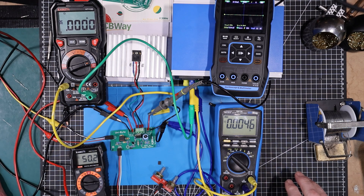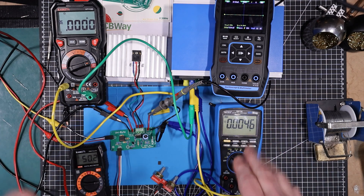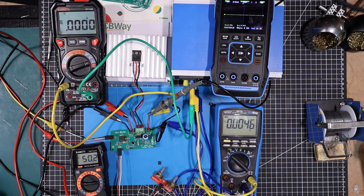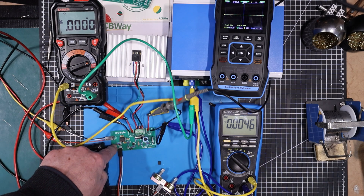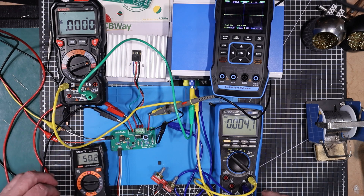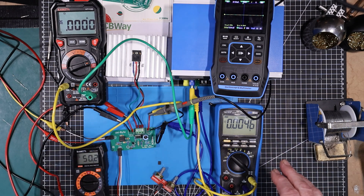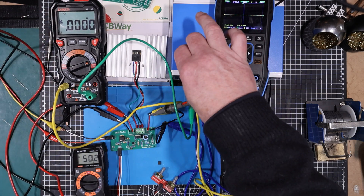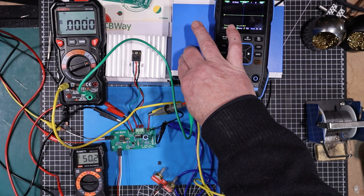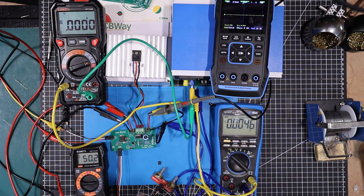Okay folks, we're back here and we're ready to test. This is actually two days later because, you know, I live in interesting times. Let me tell you how I've got all this set up. I've got plus and minus 12 volts coming in for the op amp and the voltage reference. I've got 50 volts coming in as our unregulated supply — it's coming in from a variable voltage power supply because I need variable voltage for some things. I have this meter set up to measure the current on the output, and the output is going into this passive load, which is set up to give us about 1.5 amps thereabouts given the anticipated output voltage.